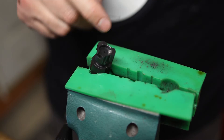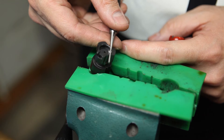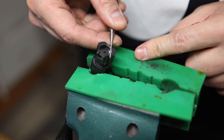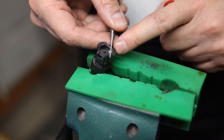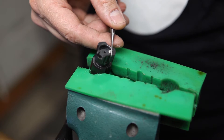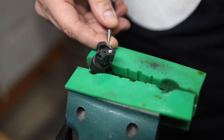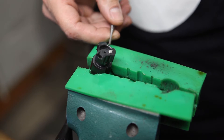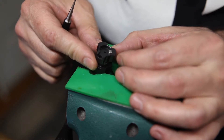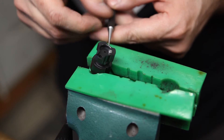The next step is the ejector. There is a hole that crosses through the bolt, and you want to make sure you keep that angle right. This is not directional — you can go from either direction punching it out. I tend to go from the flat side; if you have the bolt in your vise you'll see there's a little bit more of a gap on one side than the other. Basically you're going to take that punch and just tap it all the way through.